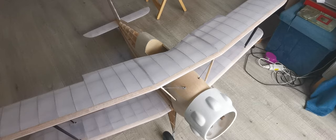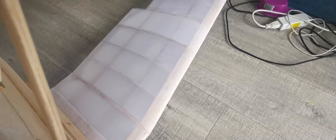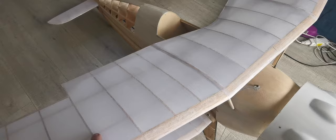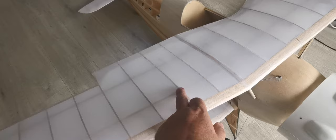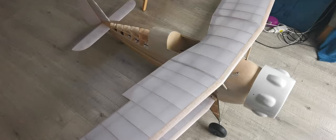It's just too unhealthy trying to do this indoors, but I have actually modified the technique lately and thought it was worth sharing. If you look very closely, you can see that the fabric on the ribs is actually attached to the ribs now. That wasn't the case with the lower wing, and I found that when it came to shrinking the fabric it became very taut — perhaps because it was shrinking across the whole length and got very close to the spar underneath. By attaching it to the ribs, that made it much more controllable when applying the heat gun to shrink the fabric.